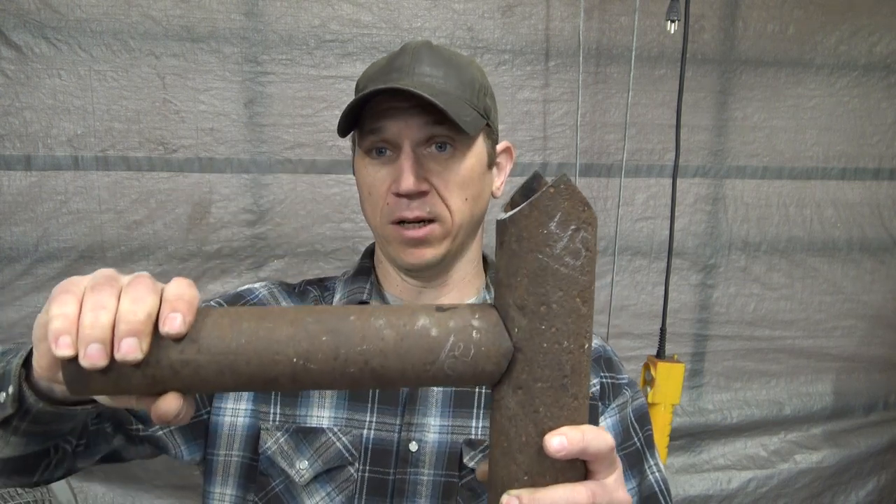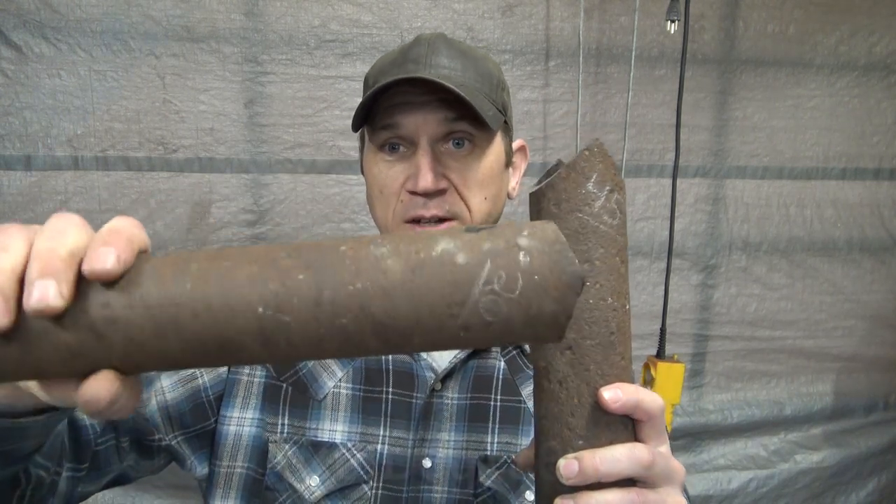Also on that post, you might want to join pipe to the side of that bigger post. To get the small pipe to saddle over the bigger pipe, that magic angle is 20 degrees, and you will have a perfect fit.